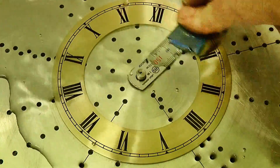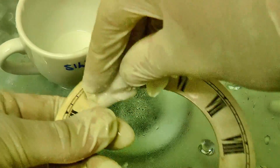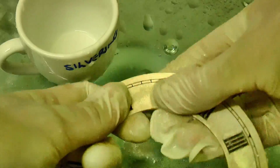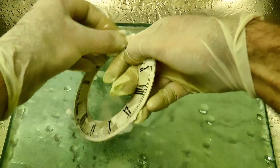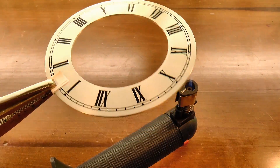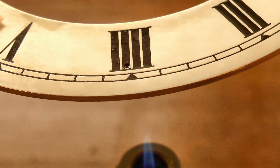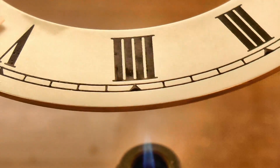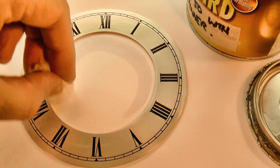And that brings me to the final step that really makes the chapter ring come to life — the silvering. The silvering compound was mixed with a small amount of water to form a thin paste, and then it was applied by hand. And then it was followed in a similar way with the finishing compound. A gentle heat with the torch finishes off the process by melting the sanded wax surface and making it shiny again. A single coat of lacquer, and it's done.